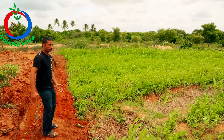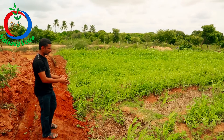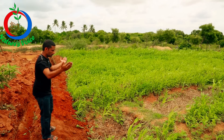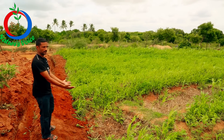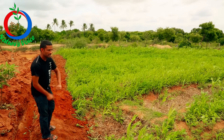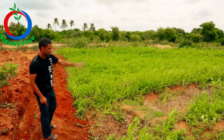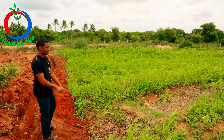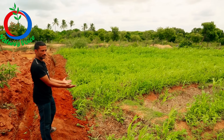What we first do is we draw a contour line at this point. And once we have the contour line, we draw lines on either side and start chiseling the sides of the swale at 45 degrees angle. The bottom has to be at the exact same level all along the length. So at the bottom, it has to be at the same exact level all the way, and we create the walls at 45 degrees angles.